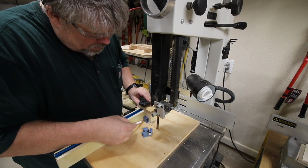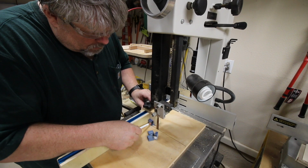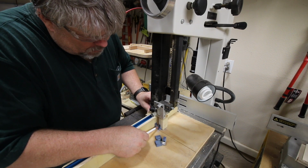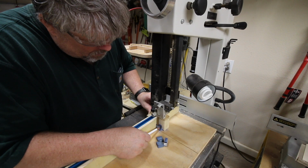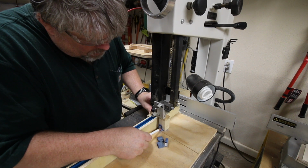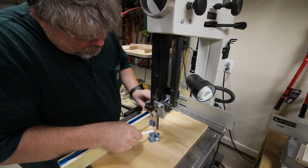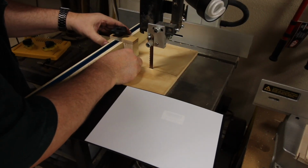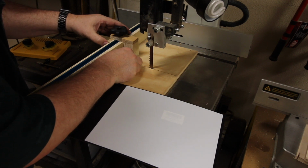I really lucked out. Now, when I was cutting these, I'm cutting them a little wider than they're going to be in the end project, because these are going to be at the end of the blank, and I'm going to trim these off with the barrel trimmers and sander later to get it down to the exact size of the tube that'll be used.